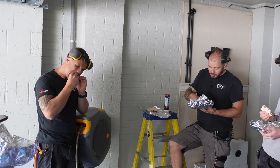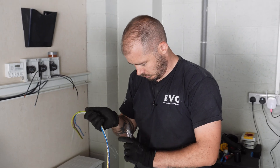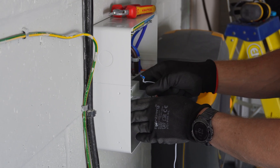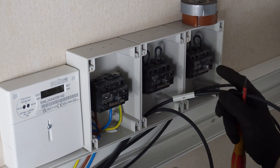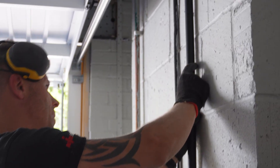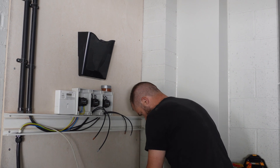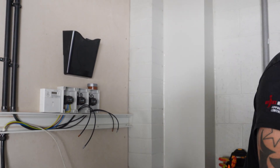We're making good progress — DC cables are in situ, the roofers are pretty much done with the mounting. Matt's putting a secondary distribution board in because the main DB is in the middle of the house and there's no real way to get to it. Modbus and CT clamp go that end and then we'll jump up in the loft for the supply. We've also left space for an additional battery if the customer wants it.